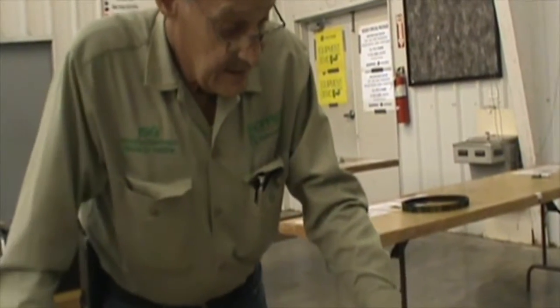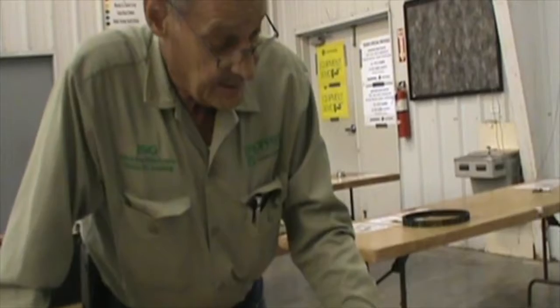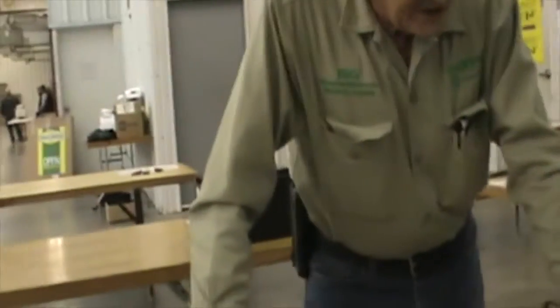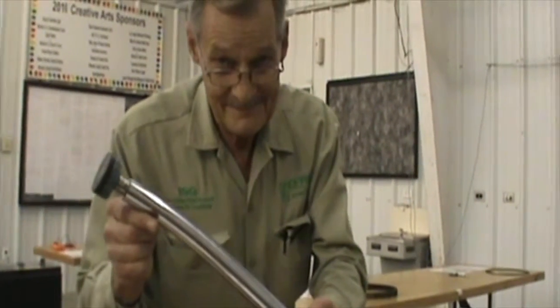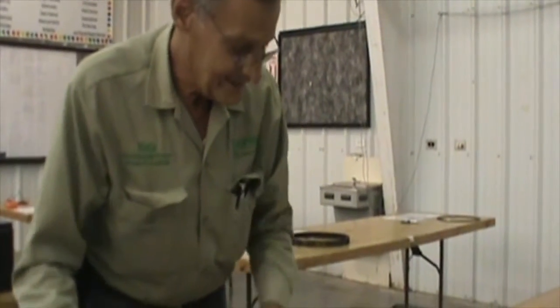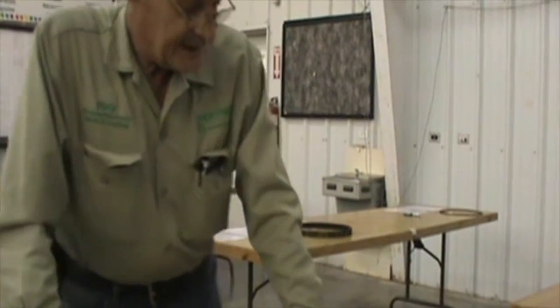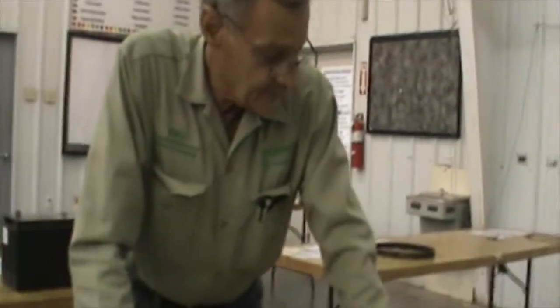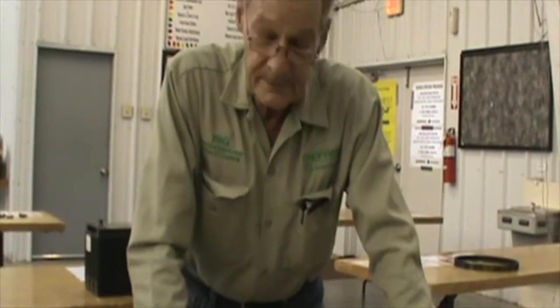The next question: is this hydraulic cylinder only a single acting cylinder? No, it's double acting. Here's a question: the entire cylinder, once you reseal it, will be fully operational? No, because the rod has been damaged. We went over the last question: if rod diameter is taken into consideration when applied hydraulic force upon the rod end of the piston, calculating the surface area of force, the force will be the same on the open face sides. It will not be the same — we've already covered that.